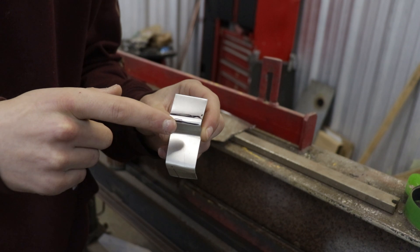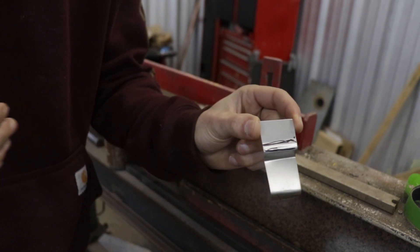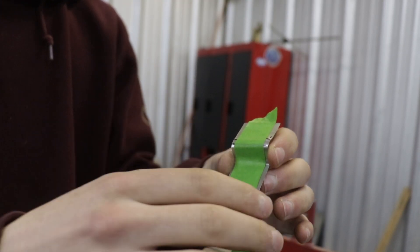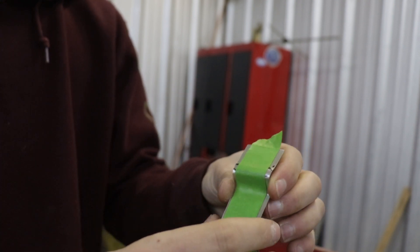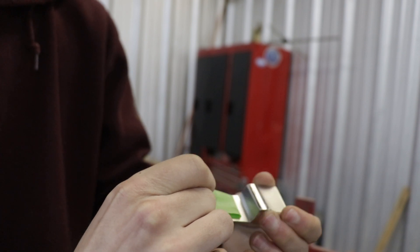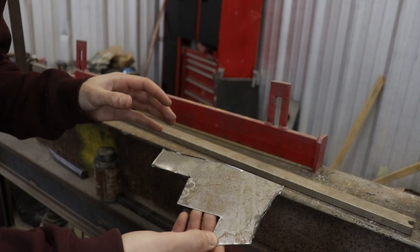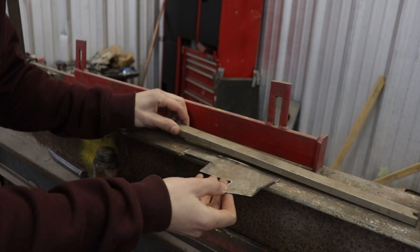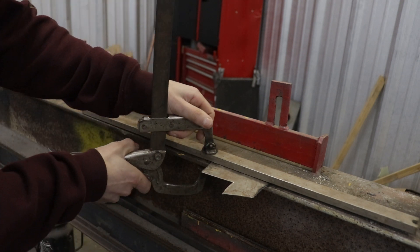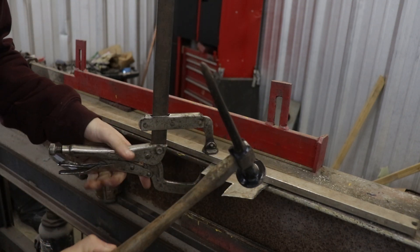This is the template I made earlier. All I want to do is have these exact bends while keeping the same height, but I want to extend it out further so that it covers the whole length of the roof. To know the exact width of sheet metal you'll need, I take a piece of tape, cover the surface area of my template, then rip off the ends and peel it back — that piece of tape is the exact width of sheet you need. Then to bend the sheet metal, you find a nice straight edge, cover your sheet with something straight, take some C-clamps to clamp it down, then grab a body hammer and tap away to get that perfect bend.